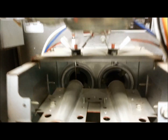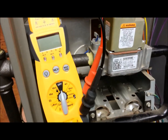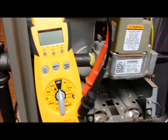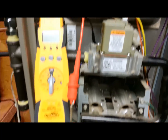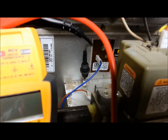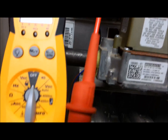First thing we're going to have to do is remove that clip. We're going to use the alligator clips on our meter to check the flame sensor. I have to run it in series through the meter so that we can check microamps. I've removed the wire — the white wire is now attached to the alligator clip here and going through the meter, back in series. The other end is attached to the ceramic above at the spade clip, going to the flame sensor.